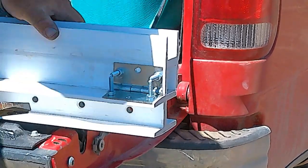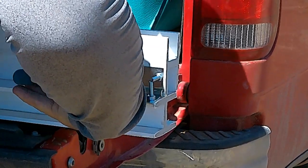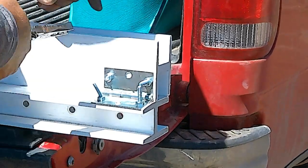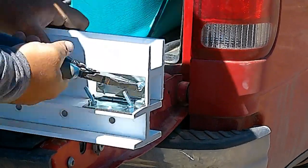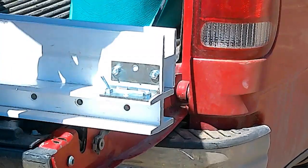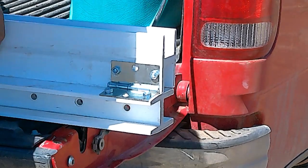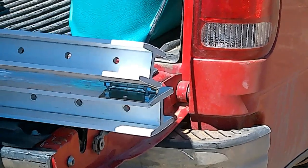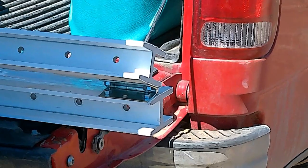These are a soft metal bolt. I've just got a pair of pliers, and you can do it with vise grips or an adjustable wrench. Just move them back and forth and they break off pretty easy. This will allow you to turn the corner in. And if it needs to go in much more than that, you don't need a corner.